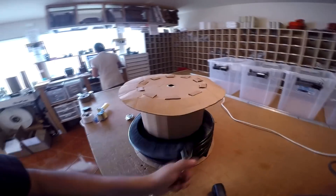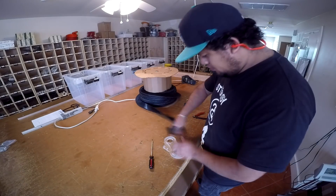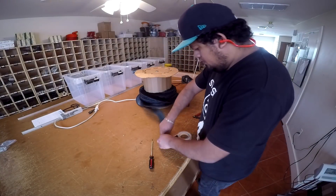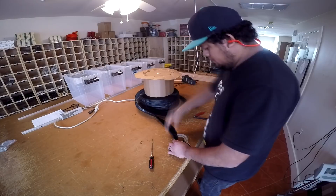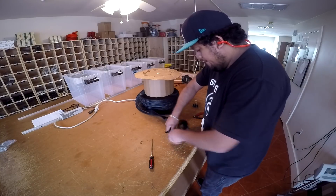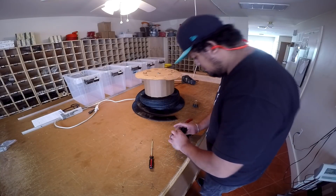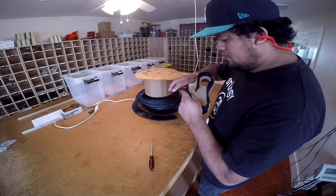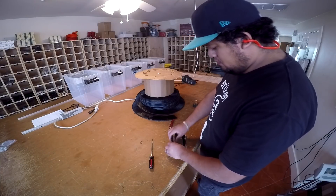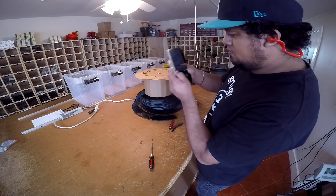We're getting the strip brush and cutting a portion of it — we get it on a roll. This strip brush is used in lots of applications; you've probably seen it on escalators. We're doing a dry fitting to get the right length and to check whether the pocket we did with the CNC was done correctly. It's tough to get that strip brush into the groove — we don't want it too loose where the brush doesn't stand on edge, but also not too tight where you can't get it in.